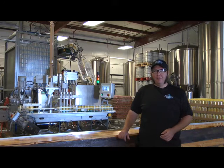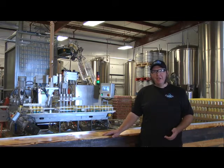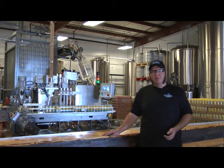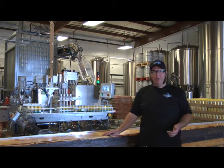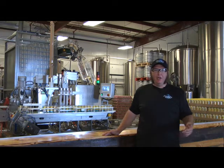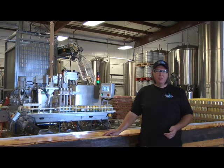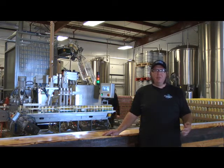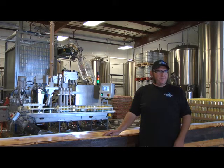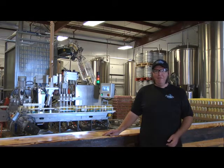Our machine does about 40 cans a minute, which works out to be about 100 cases an hour. So if we were to run it 24 hours a day, you're looking at 2,400 cases, which is somewhere in the neighborhood of 200 barrels of beer to 240 barrels of beer, depending on your loss. We get about a 2 to 3% loss most days, so that's pretty good compared to some other canners and some other bottling practices, things like that. Obviously, keg beer is the least loss you're going to get off of any packaging.